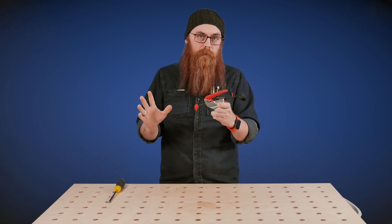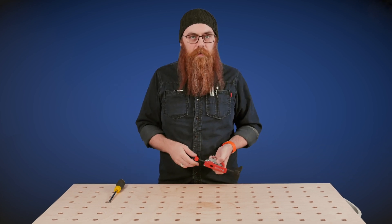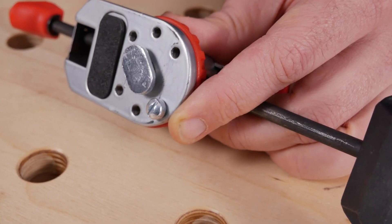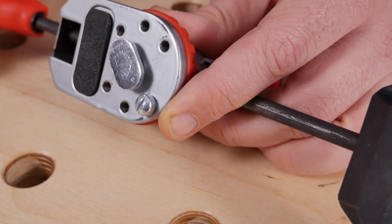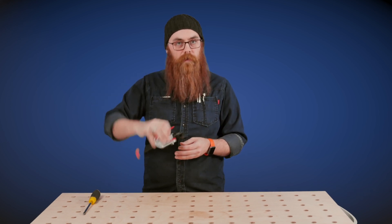Most other clamps on the market are using a design from the 1800s, maybe just a very simple lever. On the bottom of the unit are these holes here and this screw. You can take this screw out and put it in the different holes and they will change the angle that the T-bolt can go into the slot on your T-Track, so you can be sure that you're registering at a particular degree angle from the T-Track itself if you don't need it to be free 360.